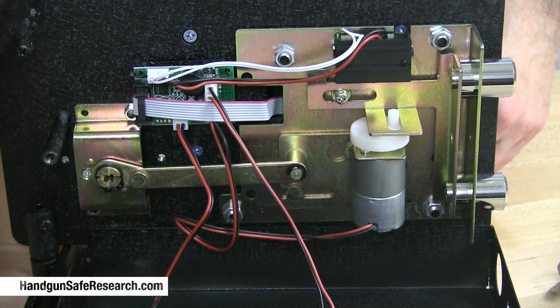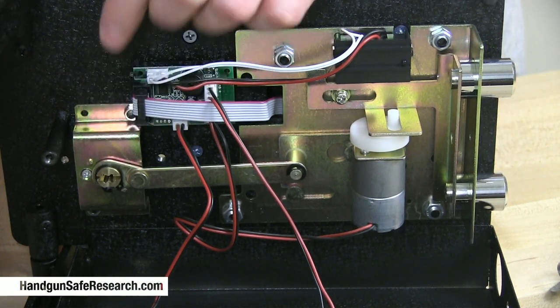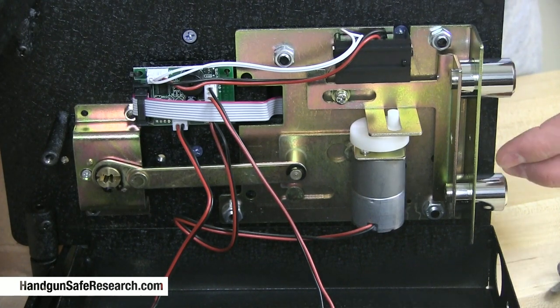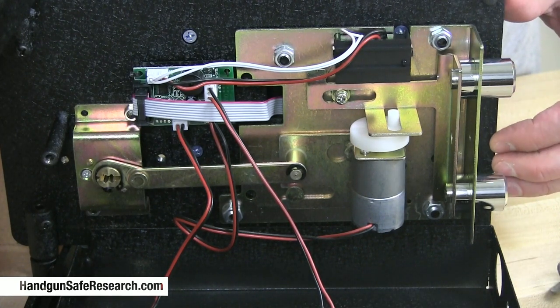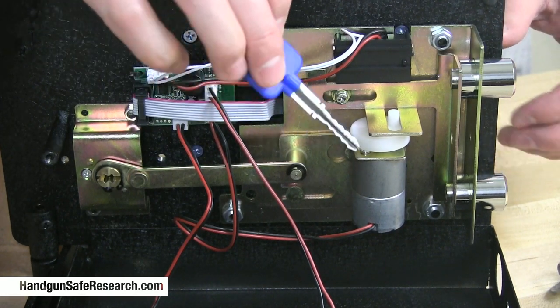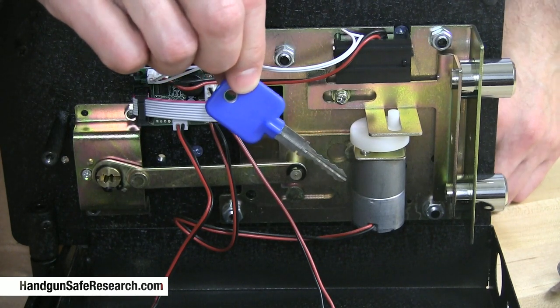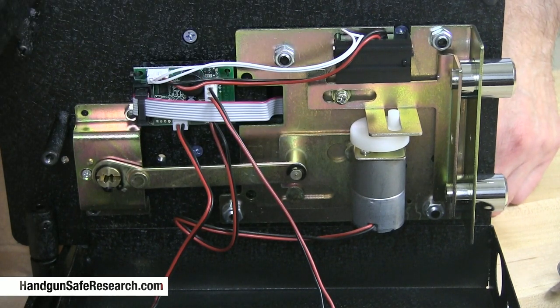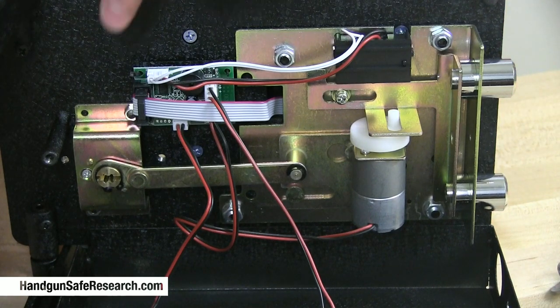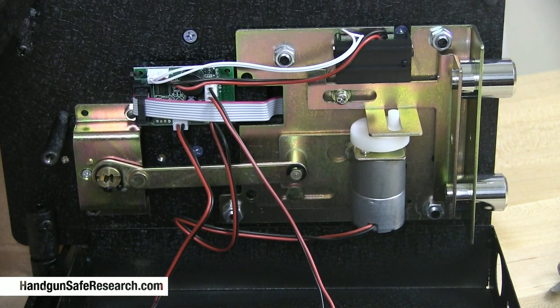The last thing I want to say is that none of these short cylinder open-ended cross locks that I've examined — and I've played around with dozens of these — none of them have had security features, no security pins. I've been able to rake open all of them using these little rakes. I paid about $7.50 for the set of them. If somebody can go online and buy a set of tools that will open any safe fitted with these cheap little cross locks, there's no point in installing these locks on safes. They're obsolete.